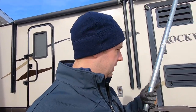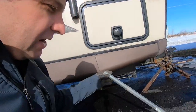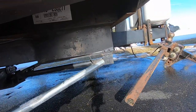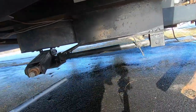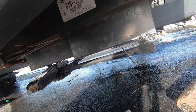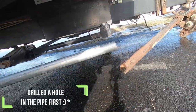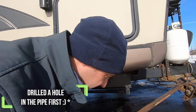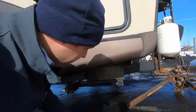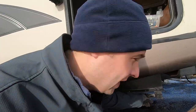I got all the materials from my favorite store, the surplus store. I found two pieces of pipe that slide in and out, then used some steel to make brackets. I got a bracket here, welded a bracket on the foot of the stabilizer, and set up a bar. The key part: I took a nut, welded it to the galvanized metal — just note that welding galvanized puts off gases, so protect yourself — then I have a bolt with a little bar welded on to lock it in place.